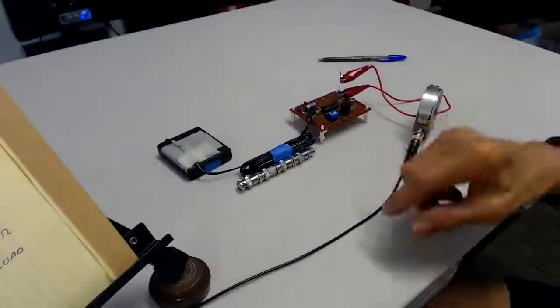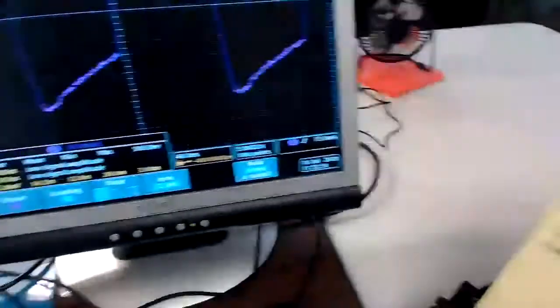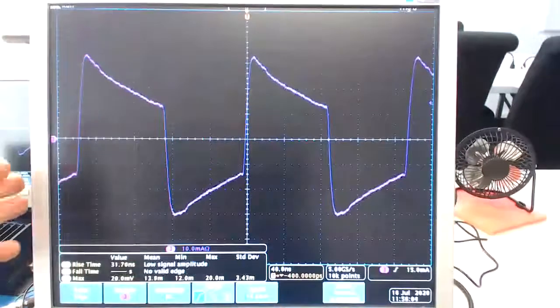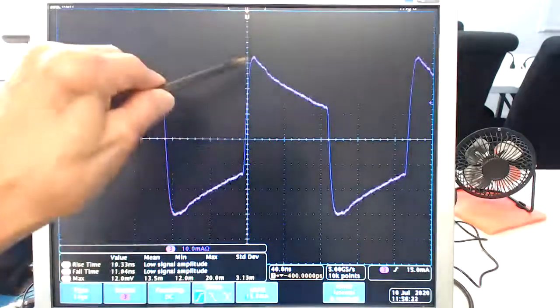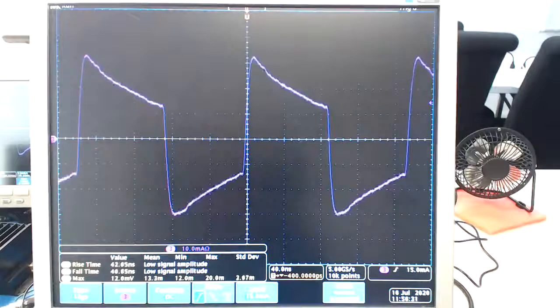So here's our test setup. We don't yet have the termination on — let's turn on the oscillator and go take a peek at the scope pattern. We're using a Tektronix MDO4104B6 oscilloscope, and I'm using an old PC monitor to make it big so it fills the screen. You can see this is the 40 milliamp step coming out of the oscillator square wave. But at this low frequency it doesn't look very flat — we're drooping down to maybe half of the initial value. That's because we're near the low-frequency cutoff of the current probe itself. If I wanted to use this probe which starts cutting off at a few megahertz to look at lightning currents or something well below a megahertz, what do I do? I could buy a new current probe, of course, but what if we did this?